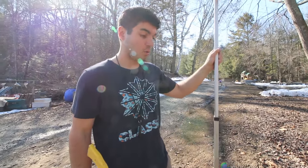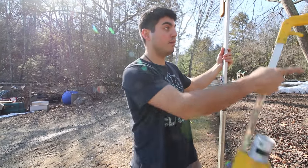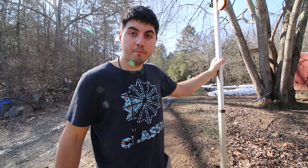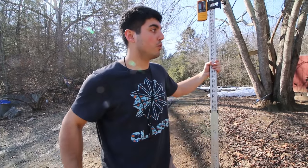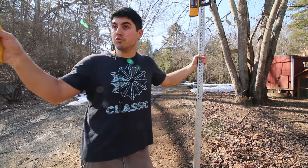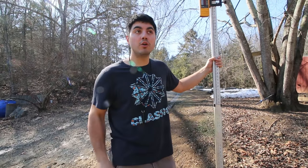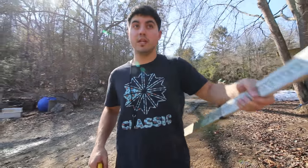So the way to find this elevation — wow, that's great! Our current road is exactly where we want to end up over there, so we're going to make this a pretty flat road. That's really perfect; I didn't know that was the case. So now using this laser target, as we dig out the earth we'll dig and then put the laser down, and if it beeps we'll know that we're right — we'll keep moving forward and make this a nice straight flat road from here to that barn door. So now I have my start point and my end point and they're the same. That means I'm going to go find a tree somewhere far away and mark it on the tree bark.